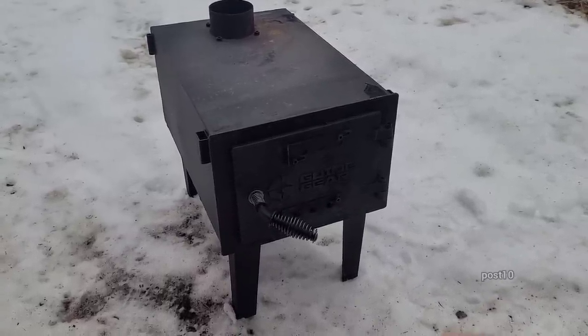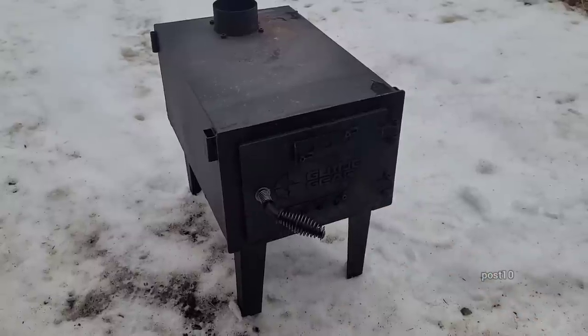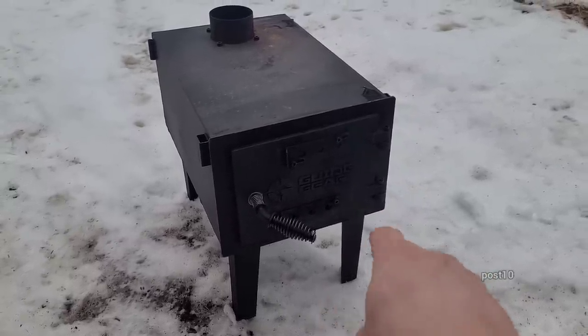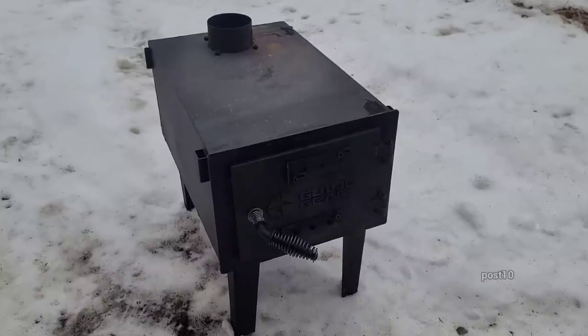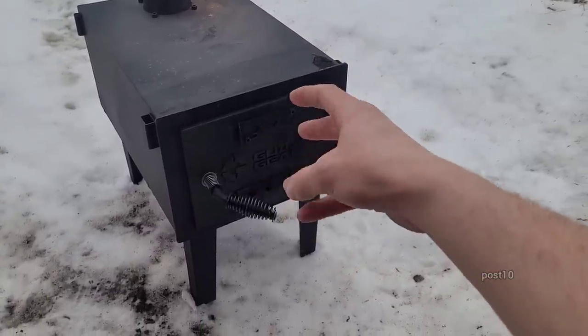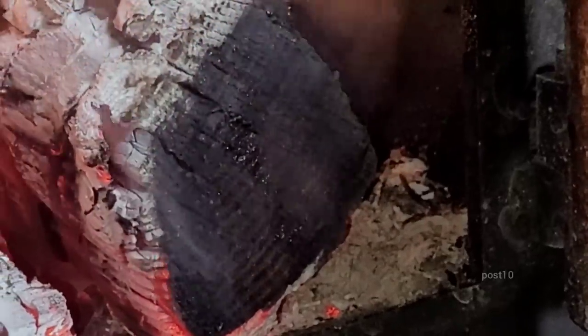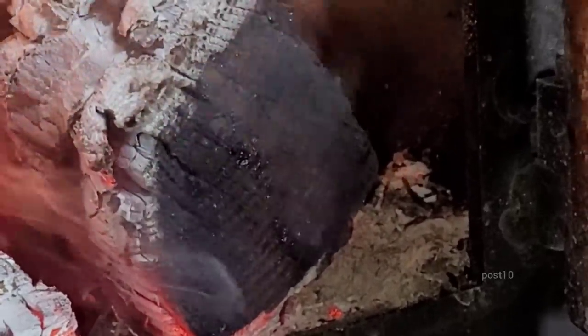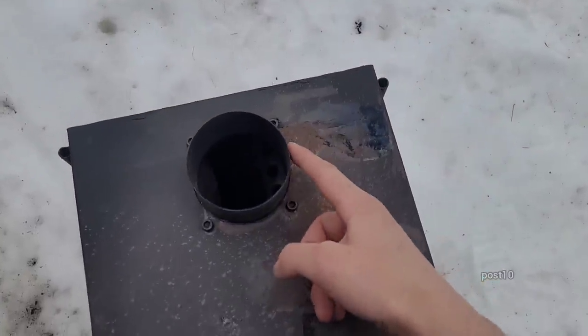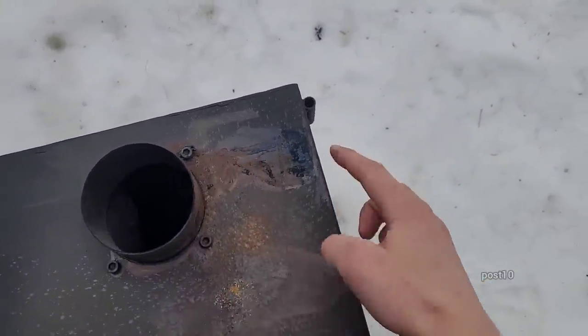So what happened was when you have firewood that's not seasoned — meaning it wasn't properly dried out — the tree is basically still alive. I burned that stuff thinking it was quality. I could see vapor water coming out of the end of it, which causes a huge buildup of creosote in the chimney pipe. So much so that it started leaking out of the joint of the chimney pipe. That's creosote.